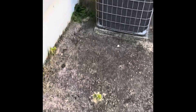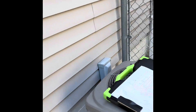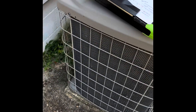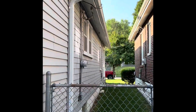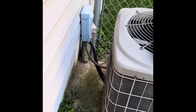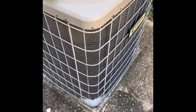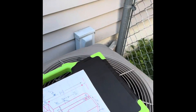We're going to go ahead and flush and pressure test our line set. It does go through a crawl space underneath an add-on and then sets on the side of the house. That's the front, coming around back with equipment. New electrical disconnect and whip coming back to the unit. New pad — should have room to get it set up in place and get it leveled up nicely.